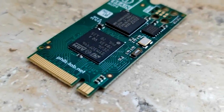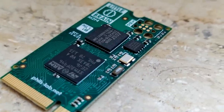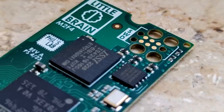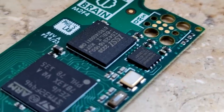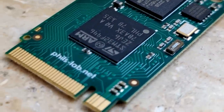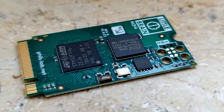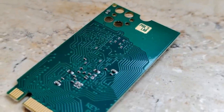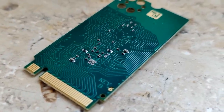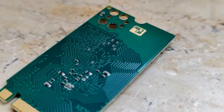In this video, we'll look at the design of this microcontroller-based system-on-module in a small M.2 form factor. This system-on-module contains a default set of components, such as a powerful STM32F4 microcontroller, SDRAM, QSPI flash, clocks, and programming interface. The system-on-module can then easily connect via a card edge socket to a suitable carrier board, with a flexible pinout useful for many different carrier board designs and projects. This eliminates the need to redesign the same MCU-based system for every new project, saving cost, reducing waste, and reducing bring-up time.